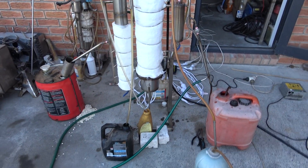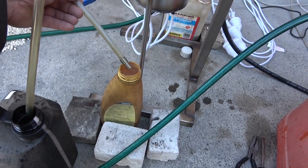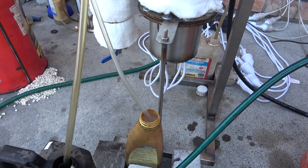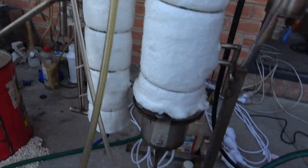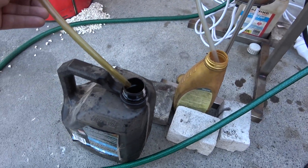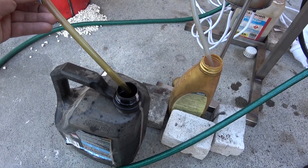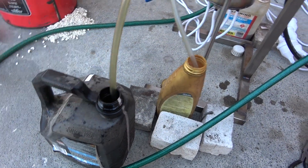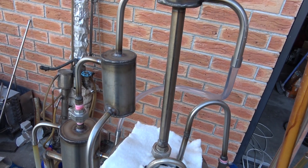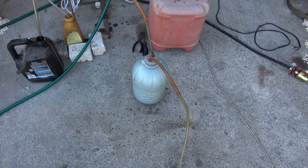The unit is working fine without any problems. We've got different fractions. There's a breather on the bitumen column on the side here — it needs to be open to the atmosphere. This condensate goes directly from the reactor up into the liquid separator on top, then down into this column, collected separately — it's more like a kerosene fraction. This other one could be more like a petroleum fraction.